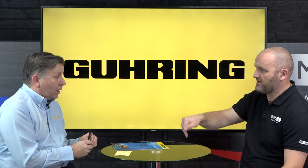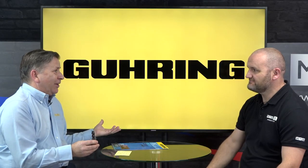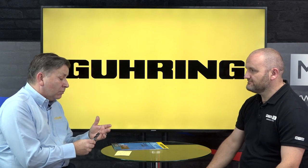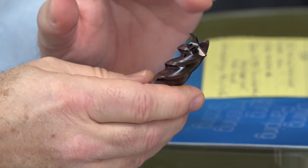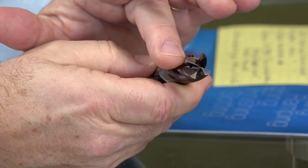When you say drill, you mean literally punch down the Z-axis? Absolutely. This is where it's unique, or relatively unique. The way it's been designed with the chisel edge and the smaller core, there's a lot of flute space on the tool which allows you, literally as you say, to use it as a drill.